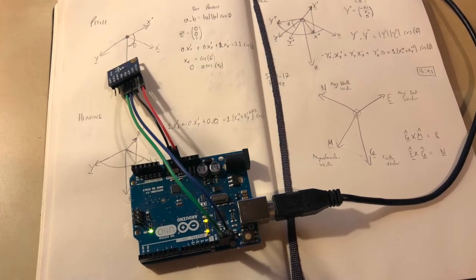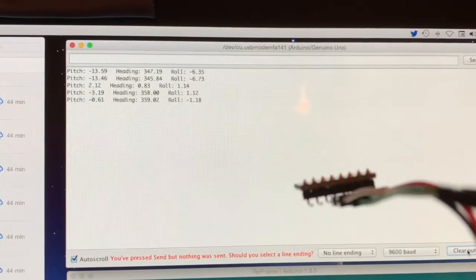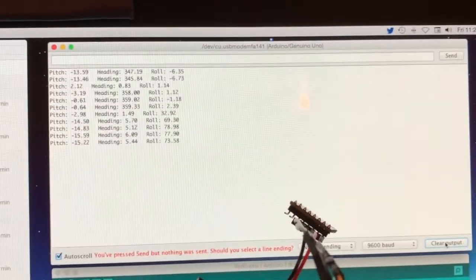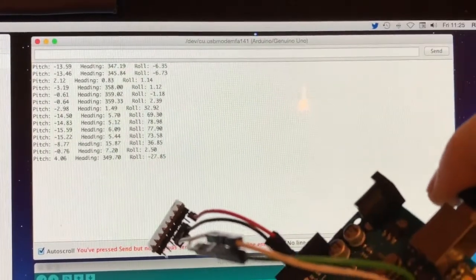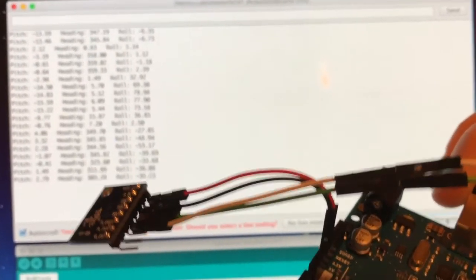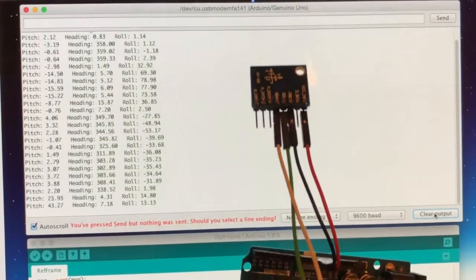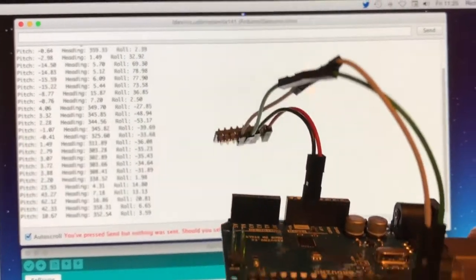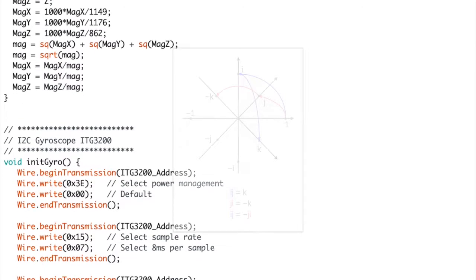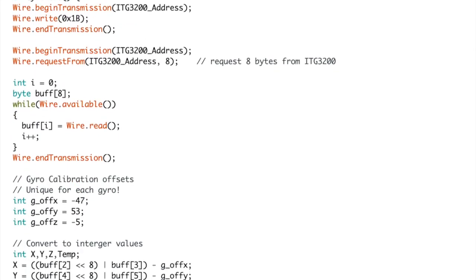I had to wrap my head around a whole bunch of vector maths, but at the end of it I really did have a system that could not only tell me the pitch and roll angles of the board, but could also use the magnetometer to work out which direction it was pointing. Now at this point I'm sure somebody might be thinking: Rich, why didn't you just download ArduPilot from the internet? Well, two reasons. First I think figuring this sort of stuff out is fun, but also now I know how it works. Yes, I know my code is probably really inefficient — I haven't even wrapped my head around quaternions yet. But I can't overstate how much I learned about digital interfaces and C programming from this little exercise.